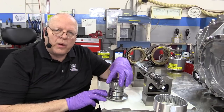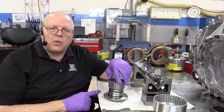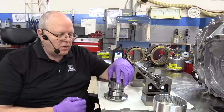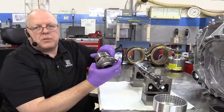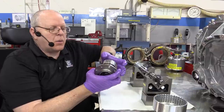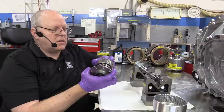This sprag should freewheel and rotate in the same direction as normal engine rotation, which is clockwise as viewed from the front of the engine. We're looking at the sprag spinning clockwise. We want to prevent the engine from spinning backwards, so we want it to lock up if we try to go counterclockwise — which it does.